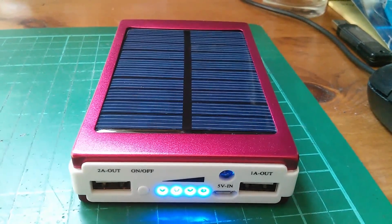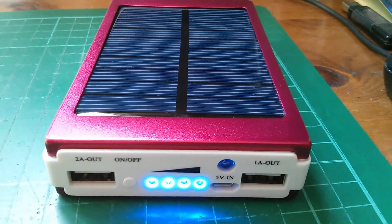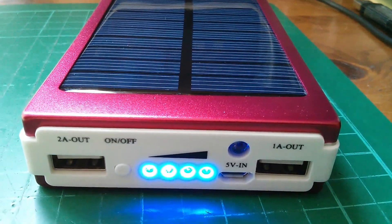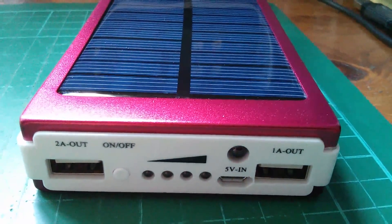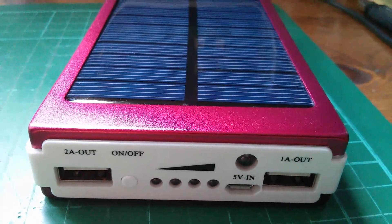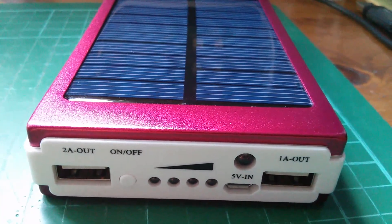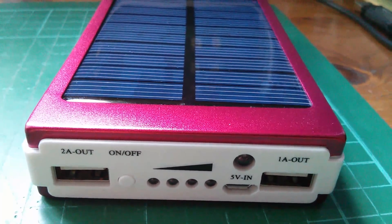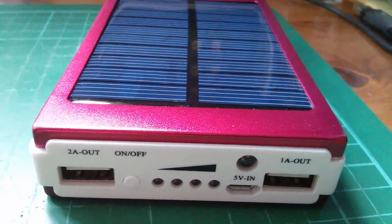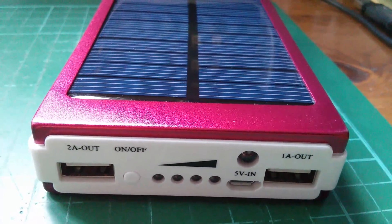Take this position here on my desk — it's out of direct sunlight. The solar panel is receiving very little power, and what's the unit doing? Well, it's just burning all the power up by putting those four LEDs on. My guess is that those LEDs must burn about 50 milliamps when all four are lit, and I don't suppose it's getting much more than about 50 milliamps coming in. So this thing at certain times just gobbles up all the juice coming in from the sunlight by switching those four LEDs on.